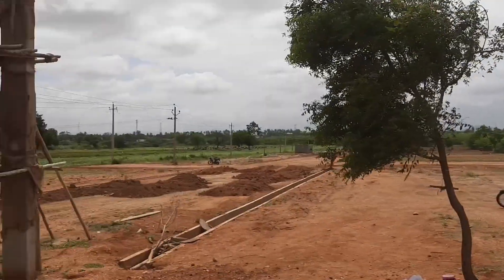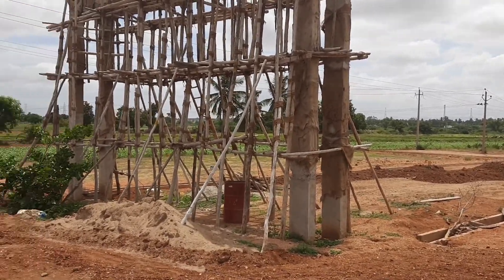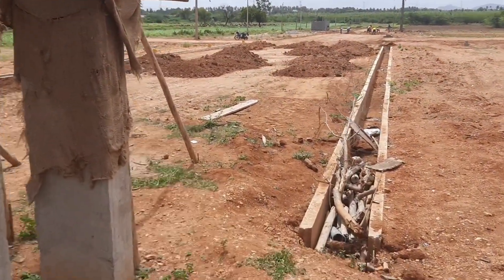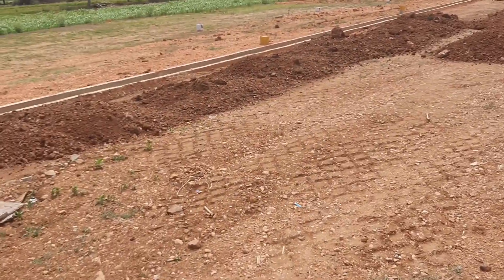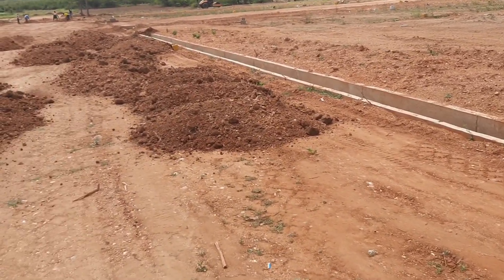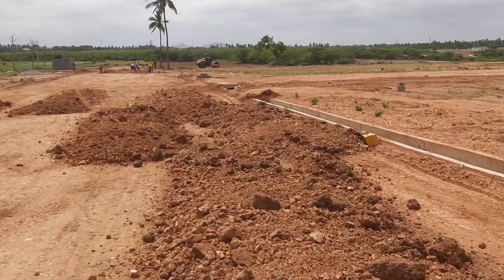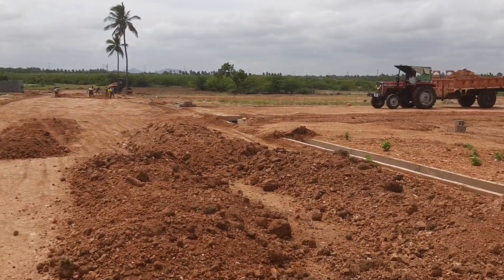Basically, we work on the entrance gate so that our layout makes a good impression when clients come to the site to buy a plot. If we talk about the road, this is our main approach road — it is 12 meters, which is 40 feet. Before the gravel, we have drainage construction at 2.5 to 3 feet from the ground. After the drainage, the rest of the road is rolled. This is the extra height we lift with the gravel.